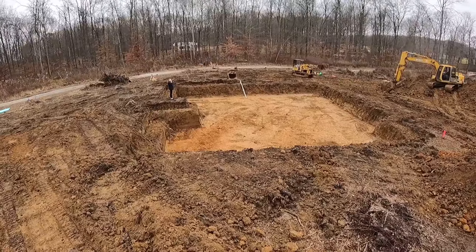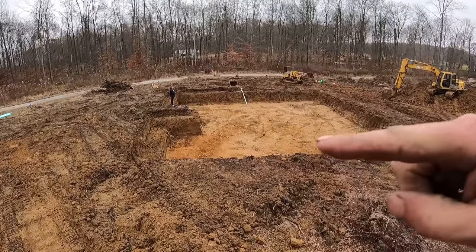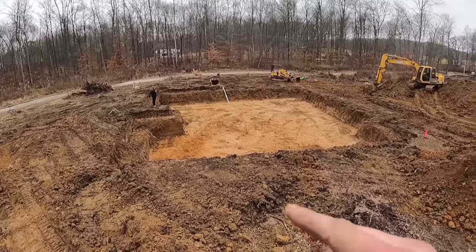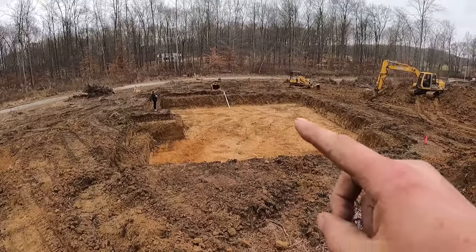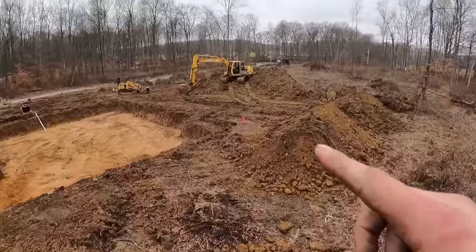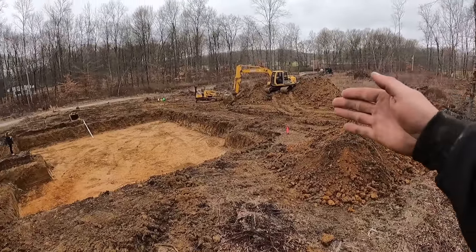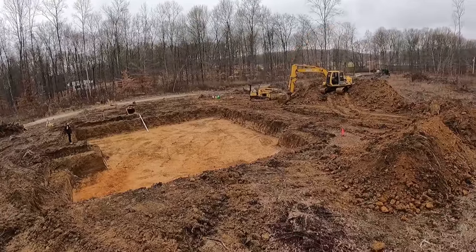Alright guys, there you have it — that is the final product. It's approximately a 2,000 square foot basement, right at 7 feet deep on average, dug down on grade. If you guys have seen the pattern we dug, we started here, worked our way across, then dug out. The purpose for that was to get the dirt stockpiled over here. The reason for that is after the foundation is in, the contractor will use that to backfill up against the house. Hopefully you guys found this video somewhat helpful and educational. If you'd like us to elaborate on some part of this video in a future video, comment down below and let us know. Again, Mike Simon, aka Dirt Perfect, on the Heavy Metal Learning Channel. Thanks for watching guys.